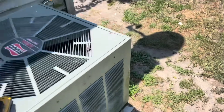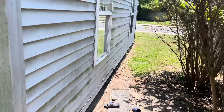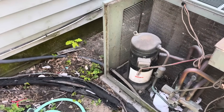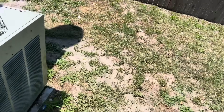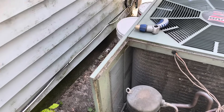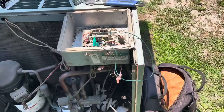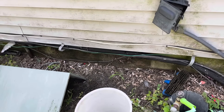I just looked it up — this is a four-ton system and it is grossly oversized for this house. That's the end of the house, single story. I measured the outside dimensions and it's about a 700 square foot house, and we've got a four-ton unit in this thing. It's a 2003, so unless somebody installed this used, it's always been like this — which is crazy. This thing has had a four-ton unit in it since 2003.